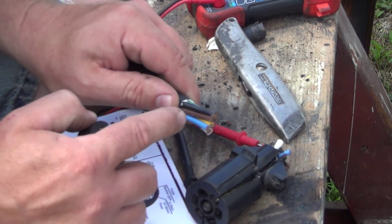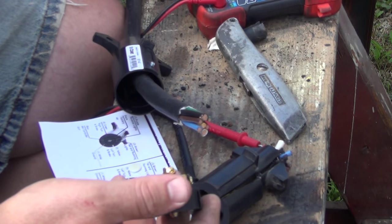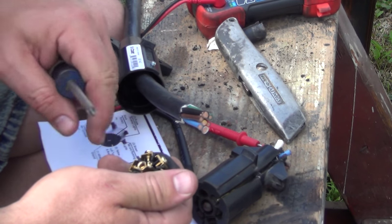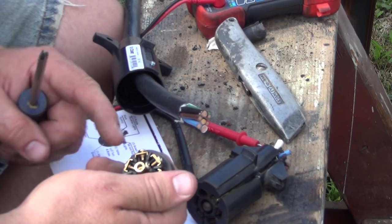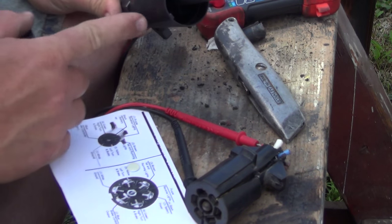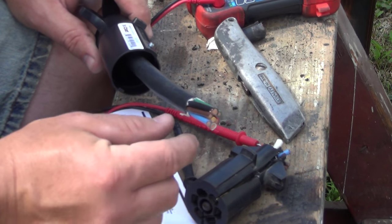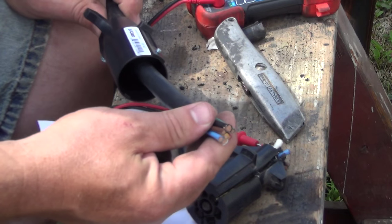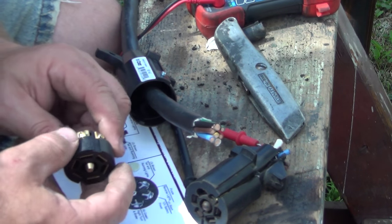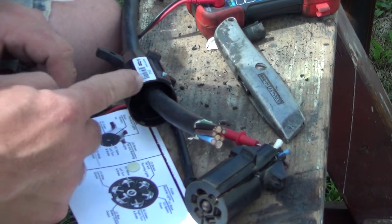What I'm going to do at this point is strip some insulation off these wires to expose bare wire, then loosen this connector up with a Phillips screwdriver so I can slide the bare wire inside and tighten it down. I already have the outer part of the connector slid onto the wiring, because you don't want to strip these back and have them all spread out as you're trying to slide it on. Keep everything nice and tight, slide it on, then spread the wires and start working with them.